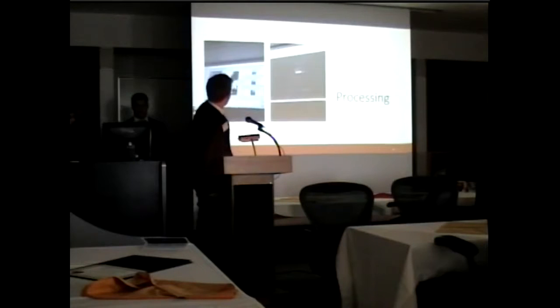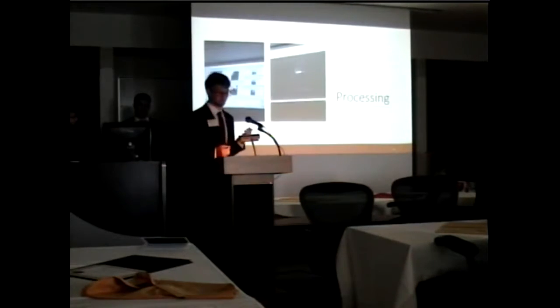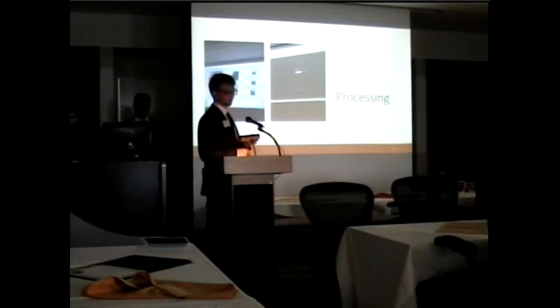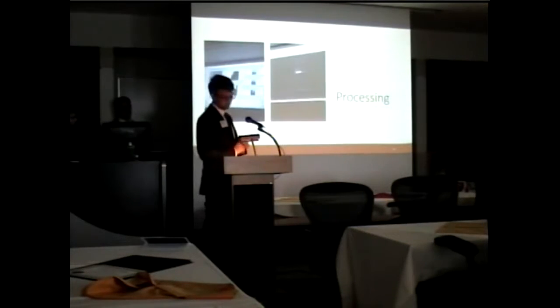So how that's done is, you can see there's a bunch of different images up there. You'd find a spot like a corner in a sidewalk or a hydrant, and find 4 images it's in, or 4 different locations during your drive. You pick a designated spot in all 4 of those images. You do that 3 times, and then the RiSCAN or RiPRECISION software will actually link the photos to the point cloud, which is pretty neat. And then once that's done, you can export your image for extraction in whatever software you would like to use.